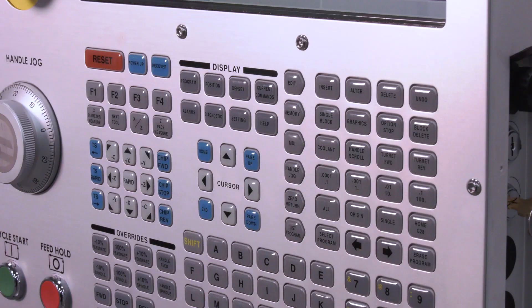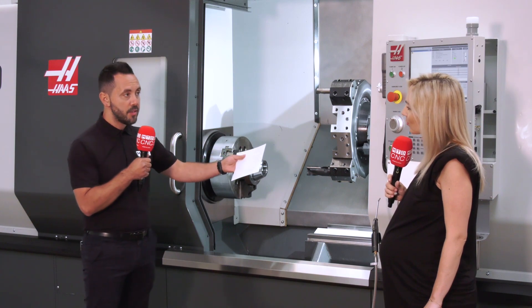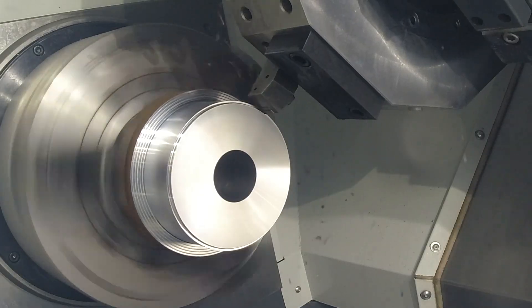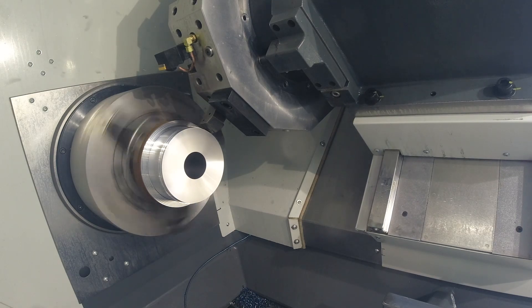You're telling me that you found the control system, from a user's perspective, very, very simple to use. Yes — I started on Heidenhain, moved into FANUC, and then into Haas' own programming language. Really easy to pick up once I had the FANUC experience. Some of the features back then were just so easy to use — you could copy and paste, create labels or macros within the program to repeat certain features. It was very, very easy to use.